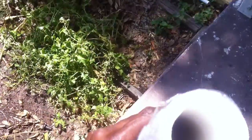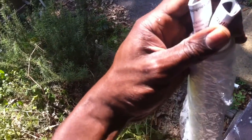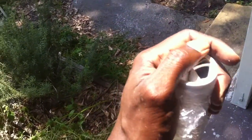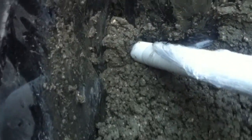Now it's time to pour some concrete. Put the plastic over the rebar so you should be able to see it in there. This is just some card stock that's about two inches in length, and I'm going to put it in the end down here so that when we start filling it up with concrete it'll maintain the position of where the eye hole will go — so that's about two inches there. We're going to go ahead and mix the concrete; all you have to do is read the bag. I'm using about a half bag. What you see is the concrete.